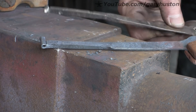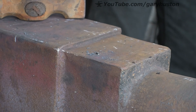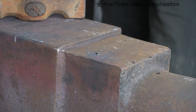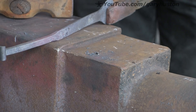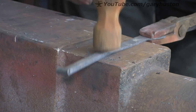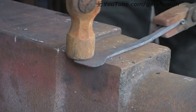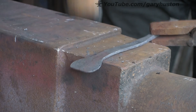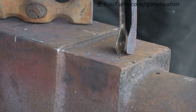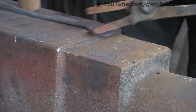So what we are going to do now is put some bends in it. You can see there is a slight bend — that one down is a bit too cold, I think I am going to heat that up because I do not want to snap it. And then the other end goes the other way — it is quite a subtle bend in it. So we have just got a slight bend that way. Let us just check it against the original — it is difficult to hold on to this thing. It is a bit too much, take it out a bit. And the other end needs to go the opposite way — I can probably do that cold or colder. There you go, pretty similar, not far off.